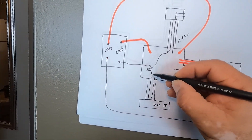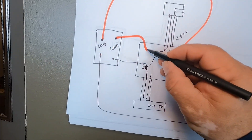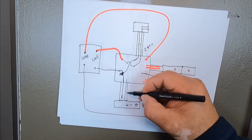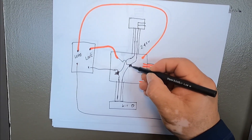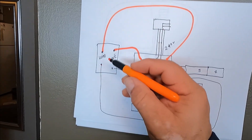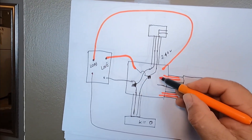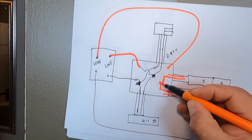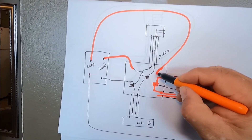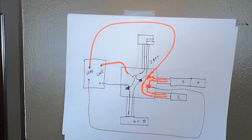So we have the wire of the heater with the line side and the line side of the breaker box. Then the other line — we're going to jump this: the other wire of the power from the breaker with the other wire of the kitchen, because it's going to be a direct wire since that thermostat controls that one. Now on the load side — the load side is always the heaters — we're going to connect one wire of one heater, then put a wire nut there, and then the other load wire goes to the other heater wire.